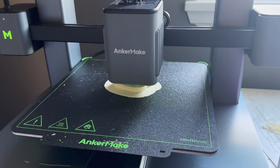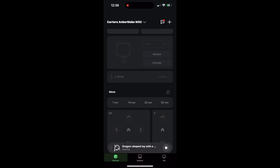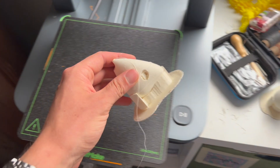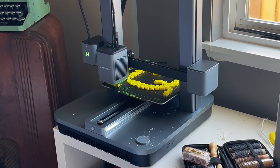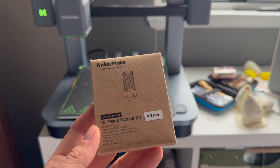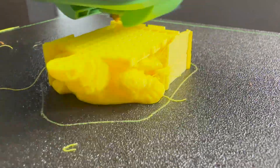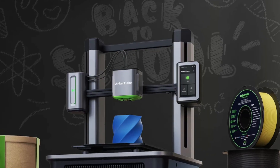And because we're talking about 3D printers right now, let's get the sponsor spot out of the way. While the M5C can be run wired with Cura, it's really designed to be run wireless with their slicer or the phone app — you just press the one single button on the printer and it goes. It's definitely a workflow designed to make it easier for people who are new to 3D printing. For a traditional FDM printer, this can run really fast — max speed is 500 millimeters per second in fast printing mode. This whole dragon was done in just about four hours. If you care more about precision than speed, they do have a precision mode: you swap in a 0.2 millimeter nozzle and it'll go all the way down to a 0.05 millimeter layer height. So in its price bracket, this printer has a unique Wi-Fi based workflow and specialty printing modes that other printers in this category don't have. Check out the link in the description if you want to learn more.